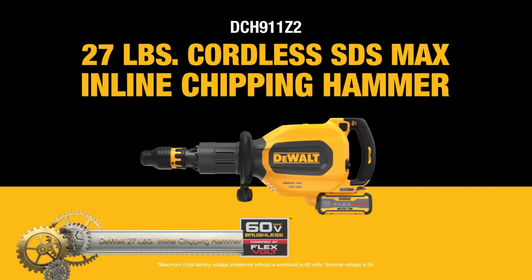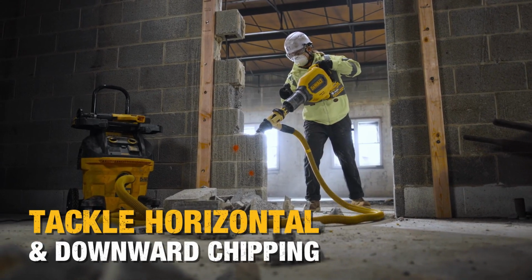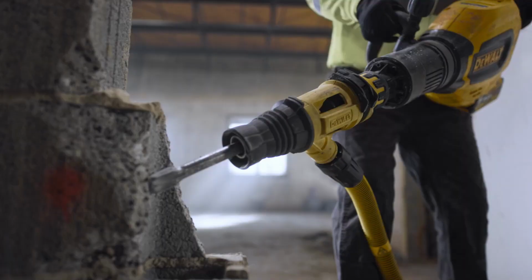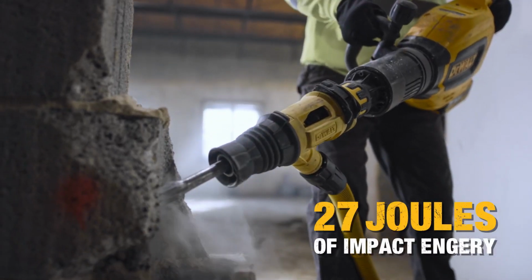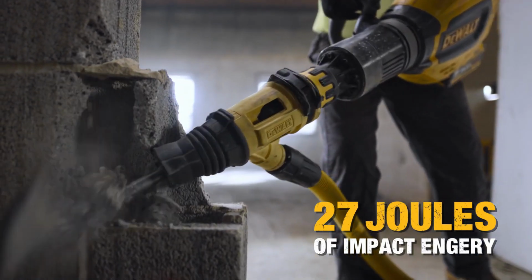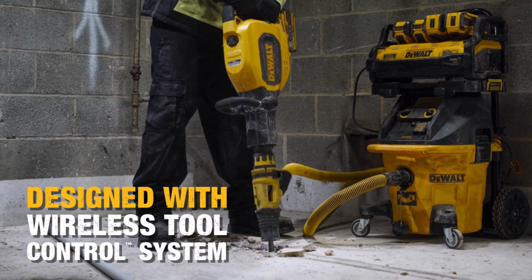The Dewalt 27 pounds. The cordless SDS Max inline chipping hammer with its brushless motor offers up to 27 joules of impact energy, ideal for heavy-duty demolition tasks. This powerful tool boasts a chipping range of 1 to 5 inches and comes equipped with a rear handle for ease of use. Additionally, its dust shroud maintains a cleaner work area.